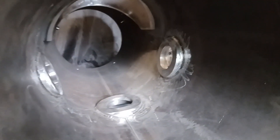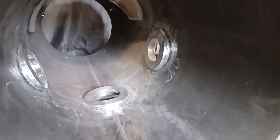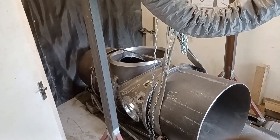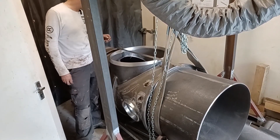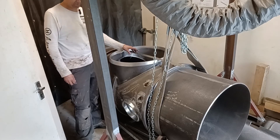All the viewports are done. I had to do quite a bit of sanding to take off the spatter because the wire was really spattery, but those are all completely done. Now I'm going to start drilling the next holes. I'm not going to weld the stuff in yet — I'm just going to drill all the holes and weld everything in one go.